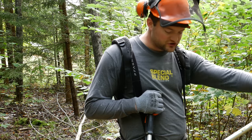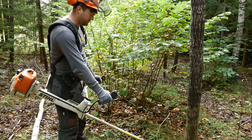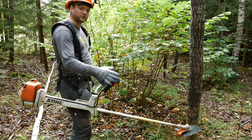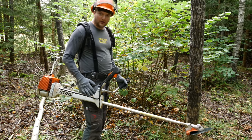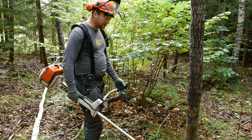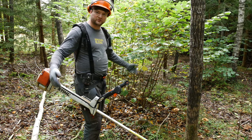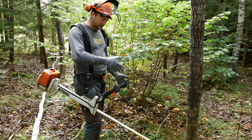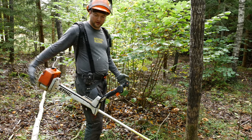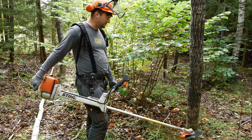The clearing saw with the blade on it is usually shorter. If you hold it, it's shorter — you would have to bend over more to reach the ground. Also, if you want to buckle this in, ideally you want to have it balanced so that the saw blade is just four to eight inches above the ground, rightly balanced. Of course, it's going to vary depending on how much gas you have in the tank.